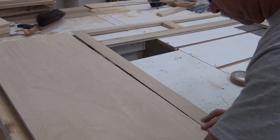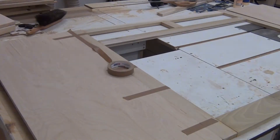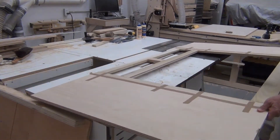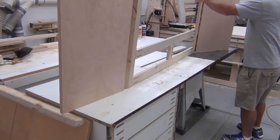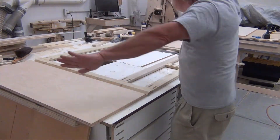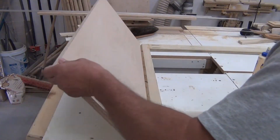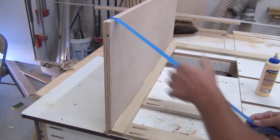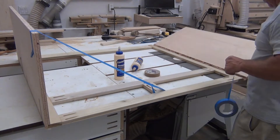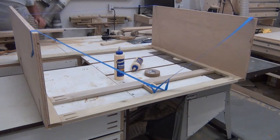I lay the frames and the sides next to each other and then tape them tight so I can make this miter fold joint. This is a heavy duty miter tape, but I found you can use blue masking tape just as well. The trick is trying to stand this thing up and flip it over. We put a little bit of glue down here — a lot of people like to over-glue it. We stand it up nice and easy, tape it off, and secure it in place. Once it's all taped and secured, we don't touch it and we let it sit overnight.